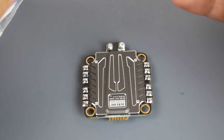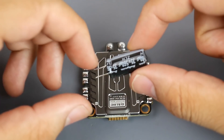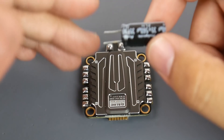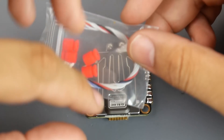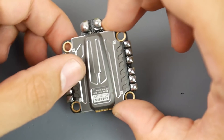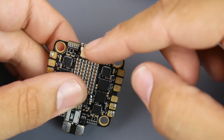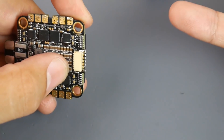They have little holes so it's very easy to install the capacitor away from the pads, and I highly recommend you do that first before setting it up. This is recommended if you're going to be using a 6S setup. Also notice it's a huge step up from their previous ESC because they've removed the pins — everybody was complaining about those — and they've set up a proper connector instead.